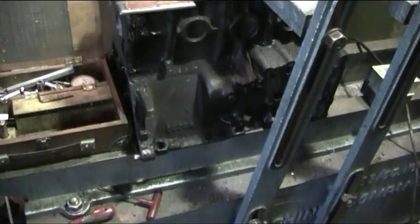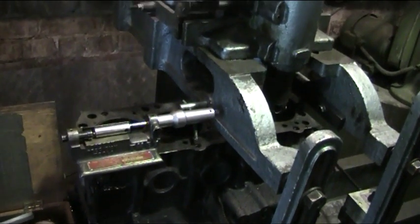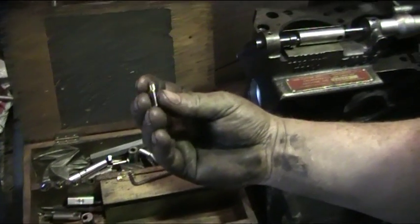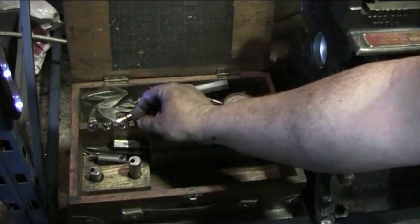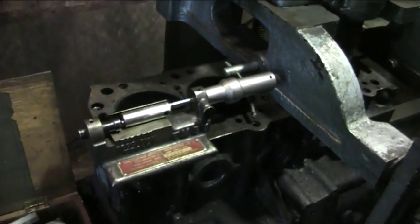A lot of the machines for cutting engines from remanufacturing shops now are most likely sourced from the Middle East. This is some of the cutting equipment, the tooling for the machine. We have the carbide tips and we also have a diamond tip, polycrystalline, and it's in the micrometer right now.